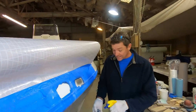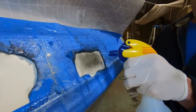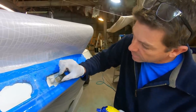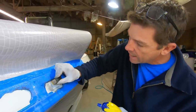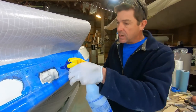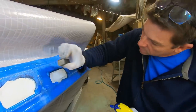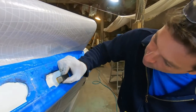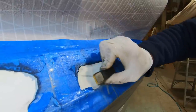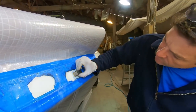That's looking good — very satisfying. I've done these kind of repairs probably thousands of times and I still get a lot of satisfaction out of doing it right. My dad used to say if you're going to do a job, do it right — don't halfway it, make it look good. You can see I'm going at one angle then another angle with a light hand. What you don't want to do is go in one groove for a long time — it'll cause an irregularity in the surface. Mix it up, go out to the edges, change direction, and periodically rinse it.